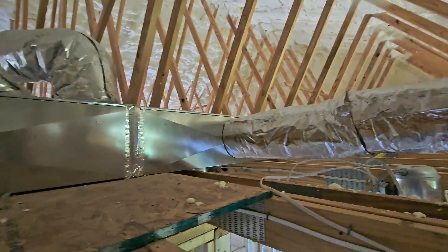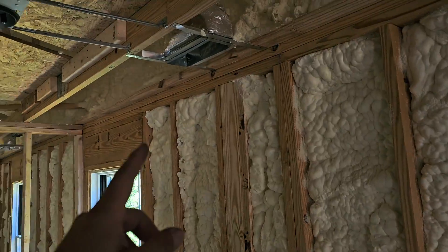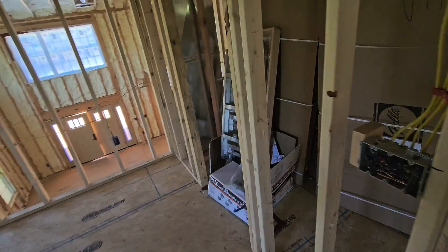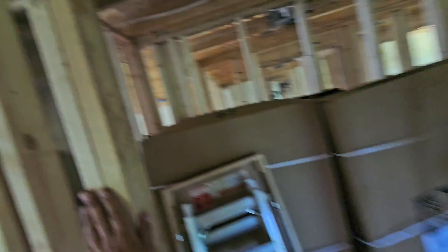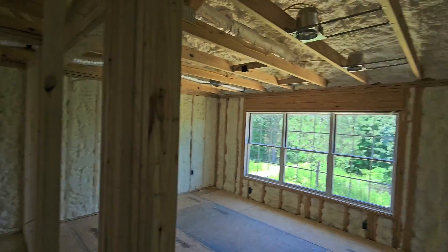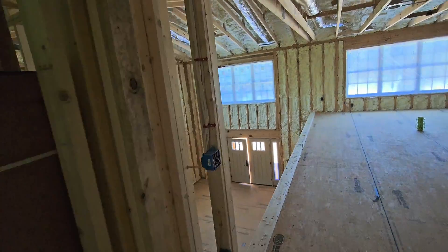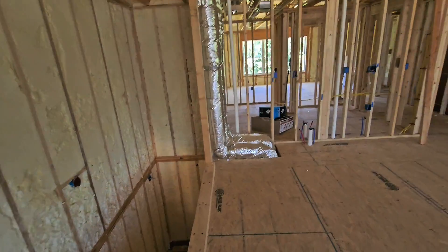Here's the supply trunk. This is a three ton unit, rated for 1200 CFM. We can do about twelve 6-inch vents with this unit. So let's count the vents: one, two — nothing here, but I'll show you how this is framed out. See that duct framed out going up and then over to the unit. So we had one, two, nothing in there, three. Then in here, four. Five. Out here, five, six. And then seven, eight. Then we've got those vents that go downstairs.